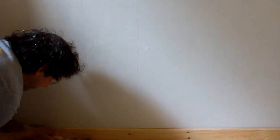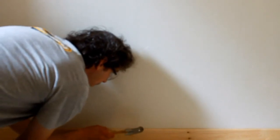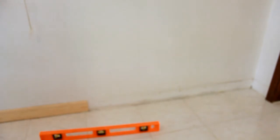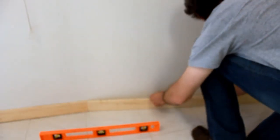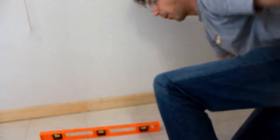You ain't going to find any butt joints in my mudroom. Lots of hammering and nail punching. Hammering the first course into place sets the foundation for the rest of your horizontal boards. You've got to check for level. Fit the next piece into place and check for level.